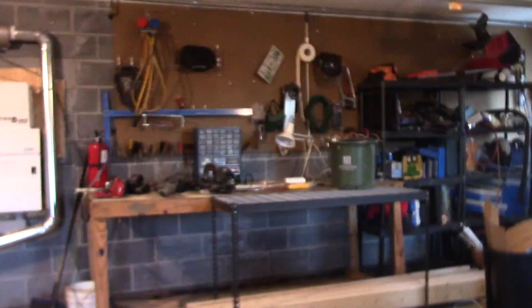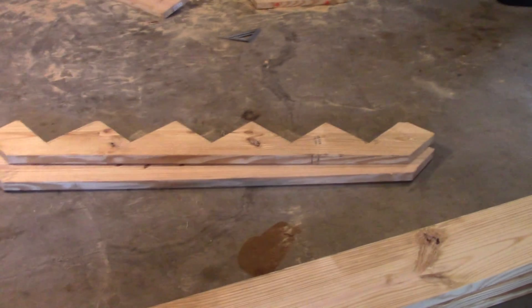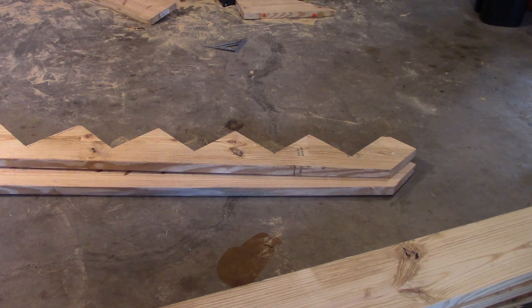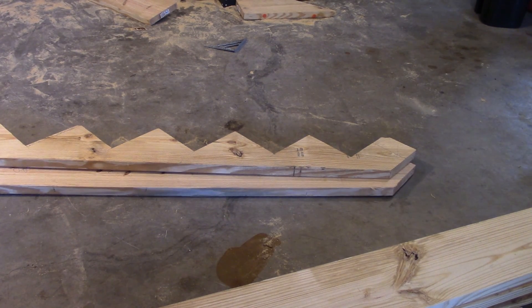Out of the 85 batteries I purchased, about seven of them didn't look great. They'll have to be cleaned up with potassium hydroxide and then placed on the very bottom row. Cleaning them will be the first priority, and charging and recharging will be easy since they'll be on the bottom row. The four rows on top will be 20 wide for operation.